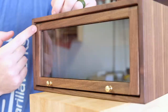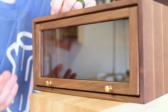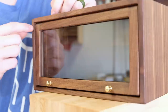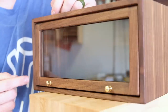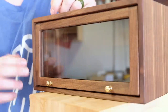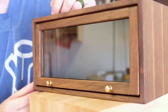These doors are joined with half-lap joints. I was going to go with traditional butt joints and dowels like I do for a lot of projects, but I knew that drilling a hole to insert the dowel that goes in the groove would probably disrupt the dowel joinery and weaken the joints. So I ended up using half-lap joints, which are quite strong and self-squaring in a way, so everything ended up square enough for what I needed — especially on a small project like this.